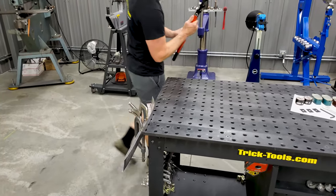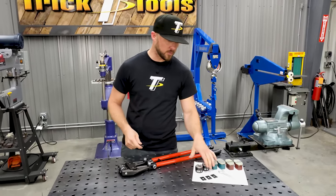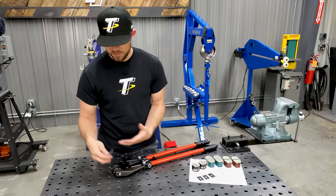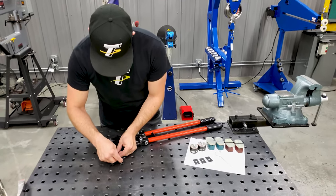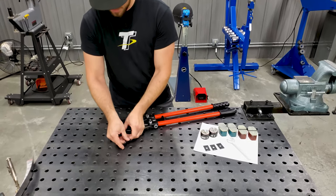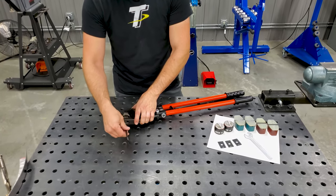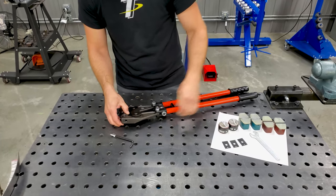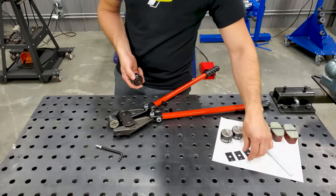It's pretty simple to do. These shims come in one millimeter, 1.5 millimeter, and two millimeter, so it's all going to be based on what material thickness you're working with. We're working here with 18 gauge steel, and this had no shims in it, so there was hardly any pressure being applied to the material, so we'll slide that out.